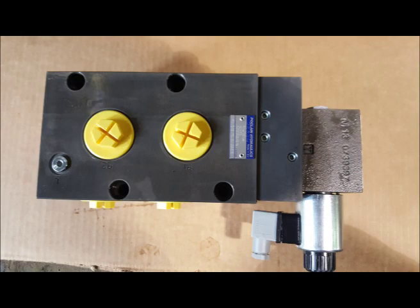This is a 6-port cast iron valve with number 16 SAE ports, used to divert the oil from fast feed to lower rotation. It enables you to run the 450 without adding a pump.